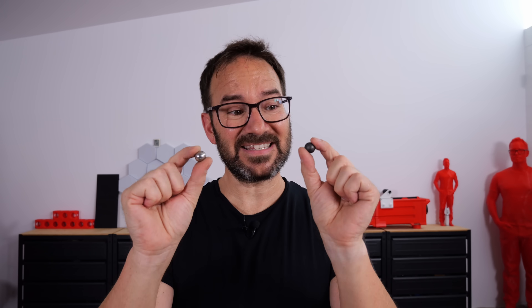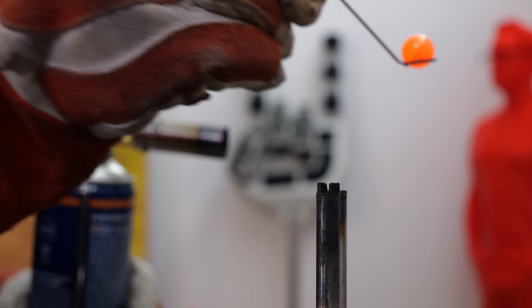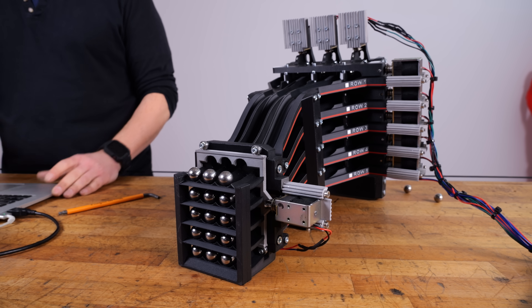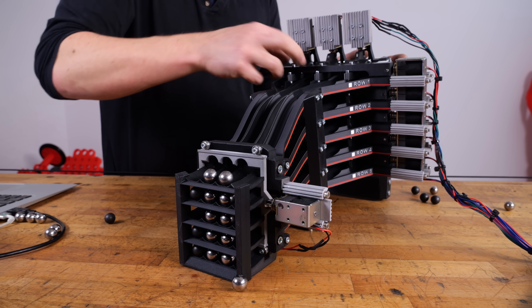The last issue is even worse because this one was self-inflicted. In a perfect demonstration of lack of personality, I read your comments and decided to go with steel marbles, and all the trouble that comes with making silver marbles black. Those black marbles were introducing a lot of friction in the system. So when I was testing just with silver marbles, everything was working, but when I switched to test with both silver and black marbles, the extra friction of the black marbles brought everything to a halt.